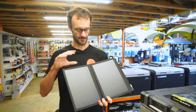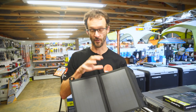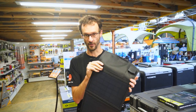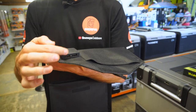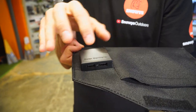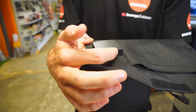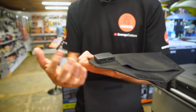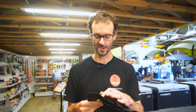Now onto the technical details. The panels themselves give out 2.5 amps at six volts. USB devices are rated to five volts charging, so you've got this USB solar controller here that outputs five volts at two and a half amps combined — two and a half amps total available from both ports. So you can have one amp from one and one and a half from the other, or two and a half amps from one, depending on what your device is going to pull when it's charging.